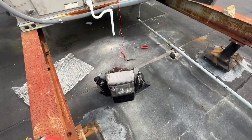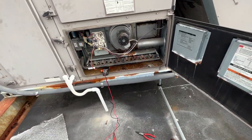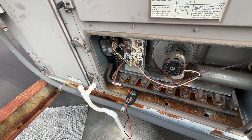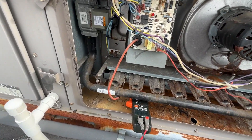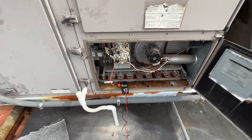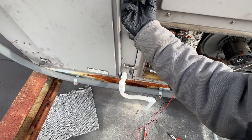Hopefully I can get them heat. I'm on the roof, you can see I got my tools out. 120 volts going to the inducer but the inducer is not turning on. We already quoted this customer for the repairs, so it's just gonna be all the same thing again.